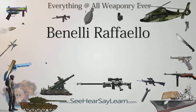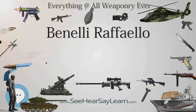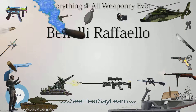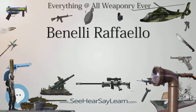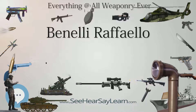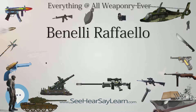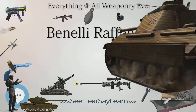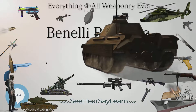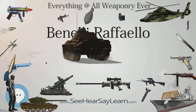The main features of the mechanism are the turning block bolt locking system and the cartridge feeding system. Benelli's range of semi-automatic shotguns operate on the same basic principle of inertial operation, with a fixed barrel, utilizing the kinetic energy of gun recoil. This system requires no outlet for gas or barrel recoil, but operates by means of a spring freely interposed between bolt head and bolt.